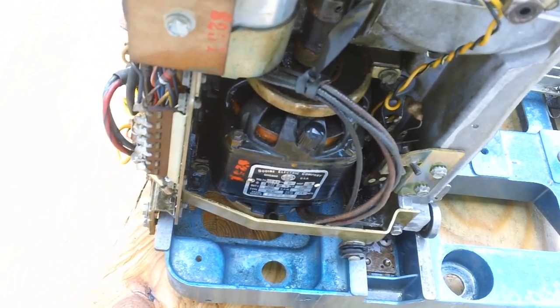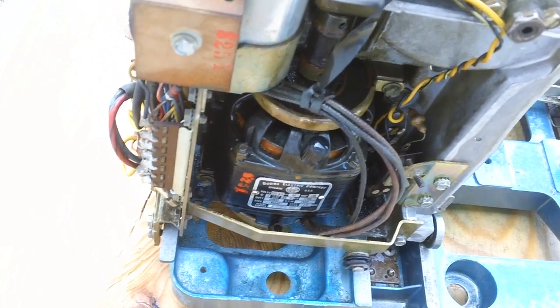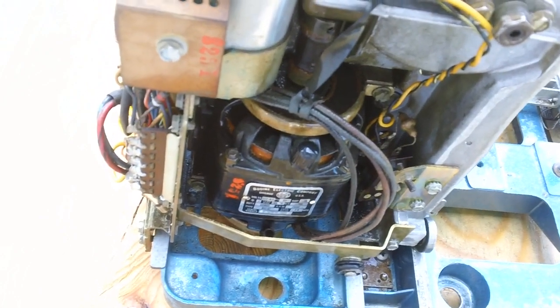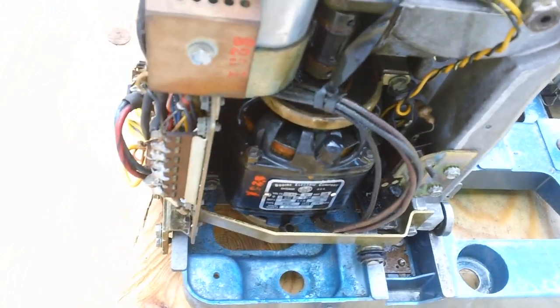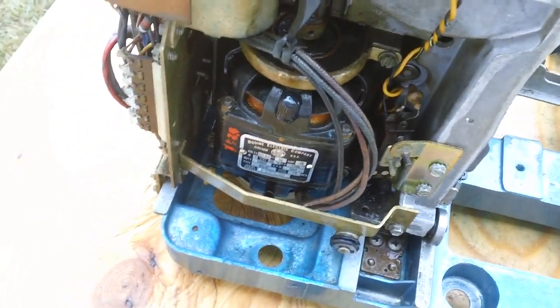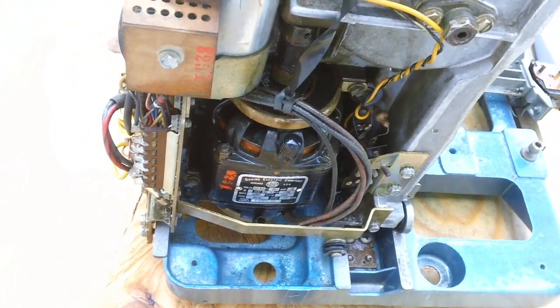They use this kind of motor because it runs at a steady, constant speed, so the records turn at a constant speed. This is why we are replacing those two capacitors that I have on order. Okay, Lockmeister, now you know. There is no brushes on the inside of that motor, and now everyone else knows it as well. Good question, buddy.